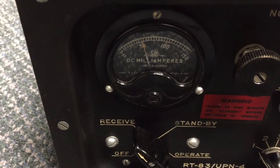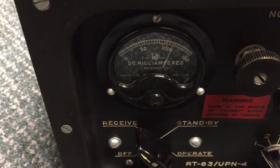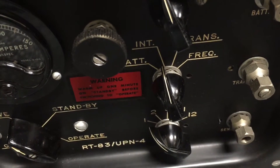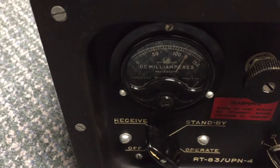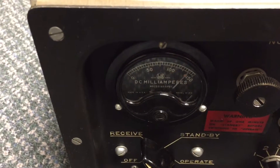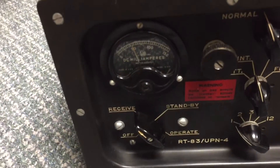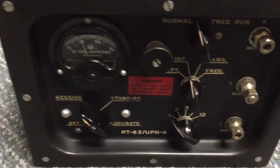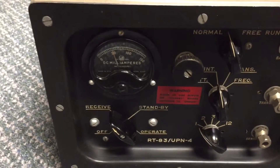It's still warming up and doing its thing. I'm going to hit it with the signal. As you can see, it indicates that it's receiving. The meter is set to the interrogate position, indicating that it's receiving a valid interrogation signal. Something coming in at 9 gigahertz with a 10 kilohertz pulse modulation was not something the enemy could really duplicate at the time, so this thing would not reply with radar unless it caught a valid signal.